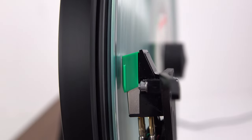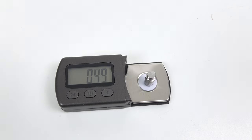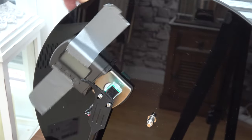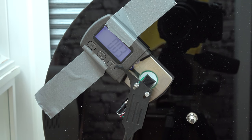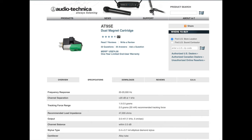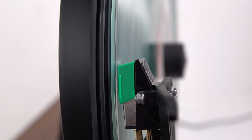I'm sure there are quite a few people interested to see how much tracking force is exerted on the record by this stylus being in an unusual position. I've got a 5g weight here — put it on these scales and it shows 5.01g, so we know it's pretty accurate. I'm taping those scales to the platter, then I'll take the cover off the cartridge, turn the scales on, and lower the stylus onto the centre of those scales. It starts off at 0.03g, so I'll take that off at the end. It shows 2.64g — so about 2.6g tracking force. The cartridge itself is the AT95E. The manufacturer recommends a tracking force of 1.5 to 2.5g, so at 2.6g it's just a little bit beyond that. I think it's pretty much within tolerances, so I'd suggest this stylus isn't going to damage your records, but it's not particularly lightweight on them either.